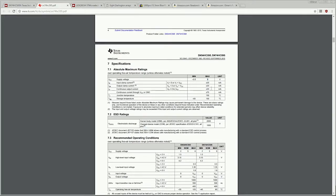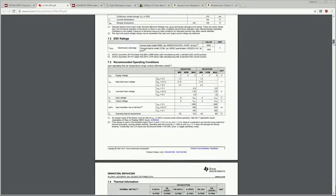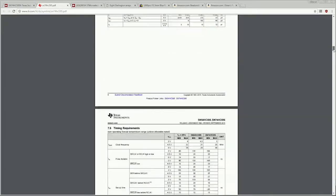The other thing we definitely want to look at here is the maximum current ratings. So driving wise, the maximum current that it can put out is 20 milliamps. Now originally when I was looking at this, I made the mistake of thinking that with our particular application, this might be an issue for us because each LED uses 20 milliamps. But then I remembered that we are using the ULN2803 chip as well, which is a Darlington transistor array, which kind of removes that requirement. The 20 milliamp range will be more than enough to saturate the base of that particular transistor and cause it to close.